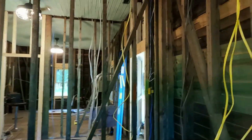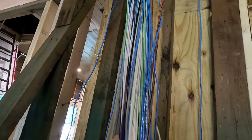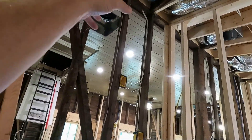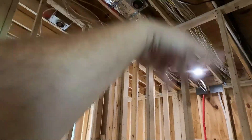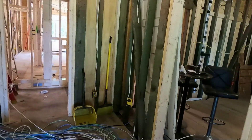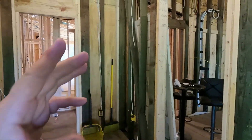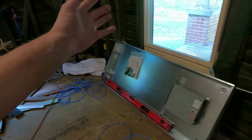Once we've done all the rooms that way, we'll go into the attic and where the wires are coming out, we'll start tying them up till they go back to the central spot — what we call a trunk line. In the case of low voltage it'll go towards this bundle, and high voltage towards these bundles. All the excess Romex will end up in the mechanical room and the excess low voltage will end up here. I'll also go ahead and remount the Crestron lighting panel and the sub panel, which we had to take out for the false wall, get the wires in there, cut them back, and have them ready for inspection.